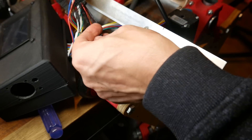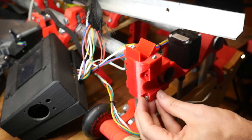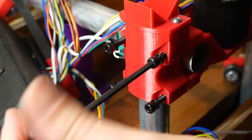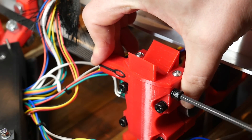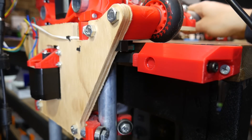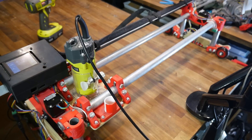Assembly is straightforward. We cut the cable ties for the existing belt and undo fasteners until the old printed piece can be removed. The replacement piece, with its top cap in position, goes into the same spot, the only real difference being that it's thicker, meaning the old hardware will no longer reach. M4 would be the ideal size, but I didn't have any long enough, so I carefully opened up the holes with a 5mm drill bit and used M5 by 45mm bolts, which were pretty much perfect. When I went to home the machine, a custom end stop switch piece was fouling on the new belt housing, but a quick dremel to remove the corner was all that was required.